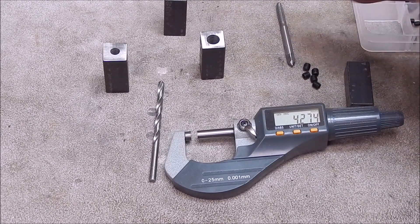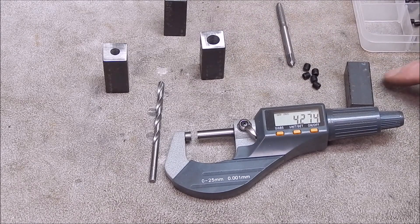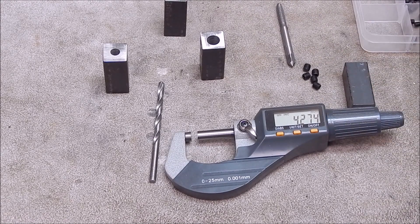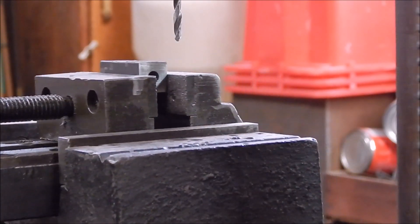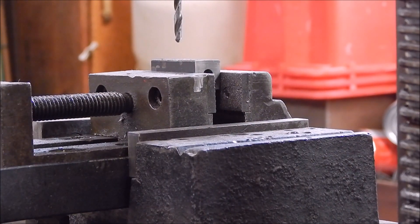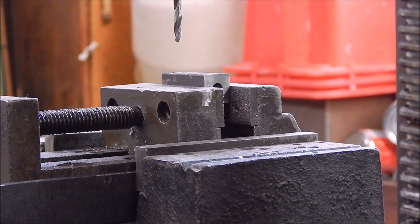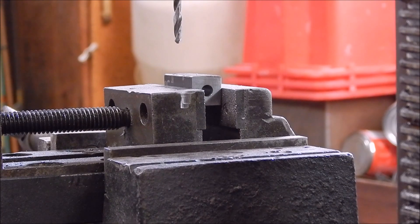Also know that when you drill, quite often the hole will be bigger than you want because of misalignment in various components. Micrometers — good things, get used to them. When you buy a drill press, always get one that's got a rotary table. That way you can position your work on two arcs that can intersect anywhere you want. Make sure it's got a rack so you can wind yourself up and down. Some of these so-called superior top brands don't have either of those features and it's just a pain.